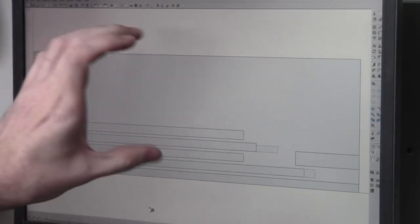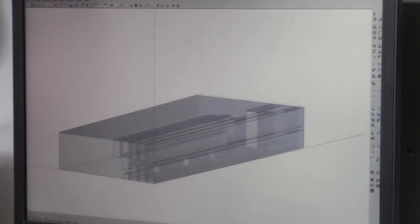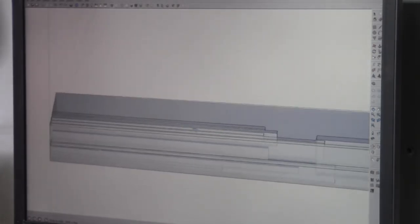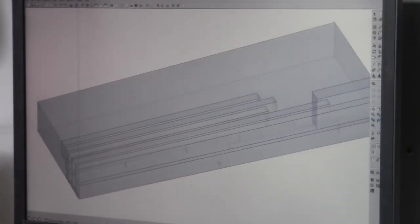So this is kind of the layout. It's the outer size — forgive my really bad screen recording here, I'm in the shop and don't have screen capture set up. This is the rough width of that piece of spruce and this length coincides to about 400 millimeters. Each of these little lines down here are the sticks. You can see it's laid out with different pieces in different locations to maximize yield. There are a couple of cuts that are full length, and then a few that are shorter than 400 millimeters. We're going to have a cutting sequence that uses the most of the board's possibilities.